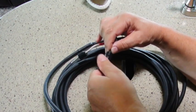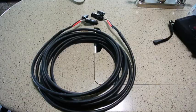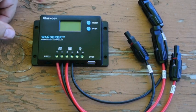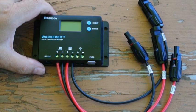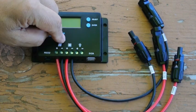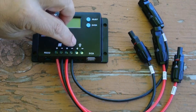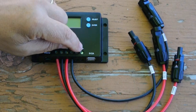The neat thing is that this can turn so you're not going to damage your connector when you tighten it down. If I've done everything correctly, I should be able to connect the two white wires together and the two black wires together. The charge controller I will be using is the Renogy Wanderer. This one is a little different than the Voyager charge controller that comes with the suitcase solar panel — the Voyager is a 20-amp controller while the Wanderer is a 10-amp controller. The main issue with the Wanderer is that it is not waterproof, so it is not ideal for use at the solar panel. The Wanderer is also PWM and it has a circuit for the load, which I will not use.